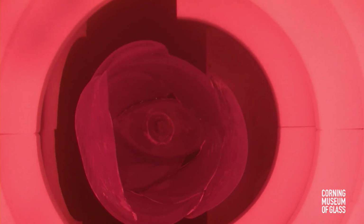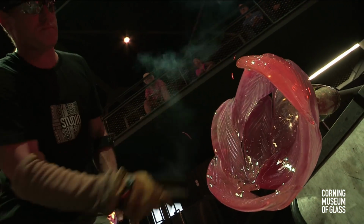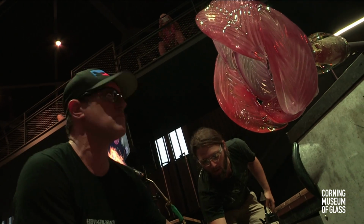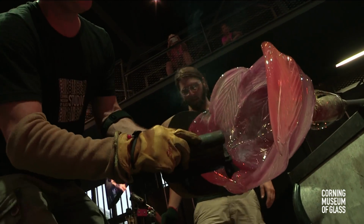Right, yeah. So are they burning themselves on these irons? All of the rods that we use are made out of stainless steel. Stainless is a rather poor conductor of heat. Now, we do have to preheat the irons, though, in order for the glass to stick to them. So the first 6 inches or so of each of those irons is mostly solid. Because it's thicker, it has more thermal mass, it maintains that temperature for longer. The rest of it is all very thin-walled tubing, so it cools down pretty quickly.